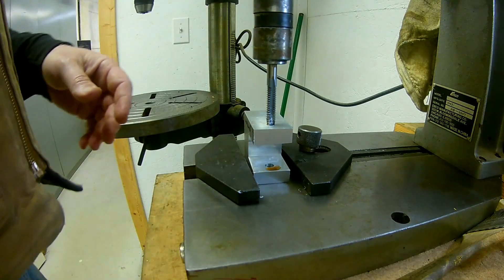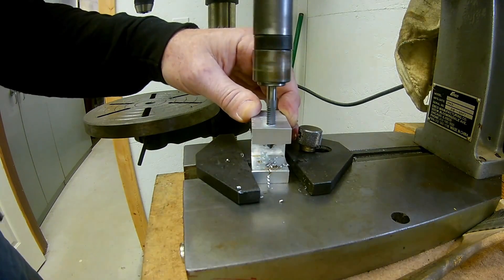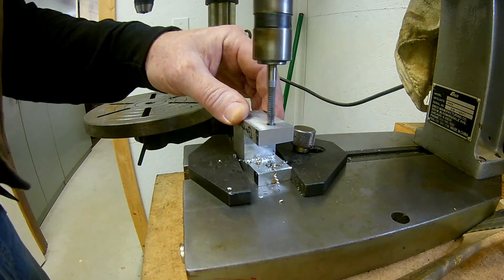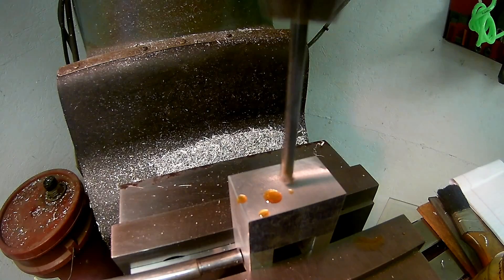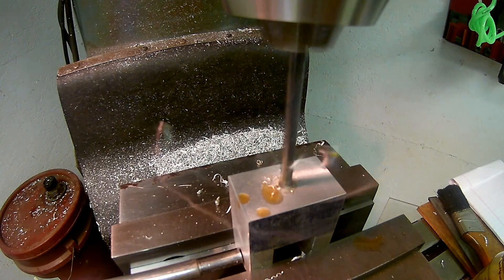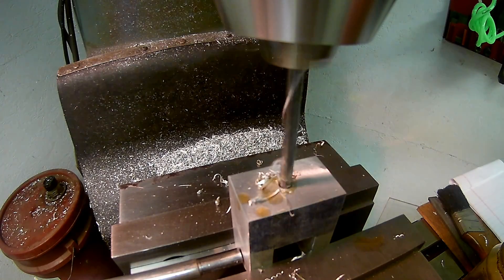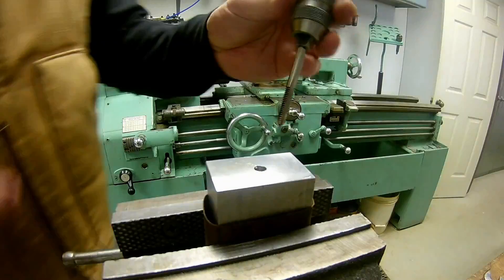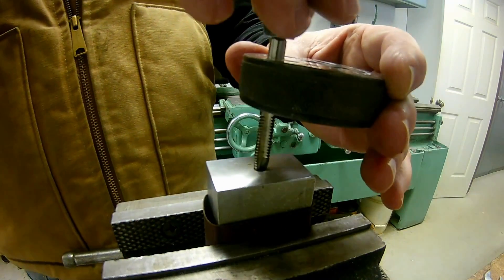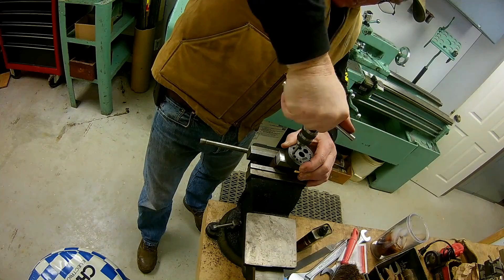So over to the tapping fixture I went and I ran in a quarter inch tap. I use this fixture whenever possible because it's quick and easy — it was originally purchased by my father after he'd had a stroke and he couldn't hold pieces as steady. Super handy, but not necessary — you don't have to have one of these. This next hole I'll do in a more traditional manner. This is the back of the tensioning block where I need a piece of quarter inch threaded rod that'll pull the entire block back, tightening up the belt. I started by drilling a number seven hole, then took it over and put it in a vise. I use a little cutting fluid and then this alignment block that my father made long before I was born — I hold it on top and carefully thread the tap in using a tapping handle. That's all there is to it; the tapping fixture is just a nice convenience.